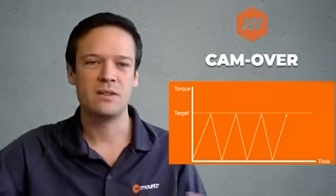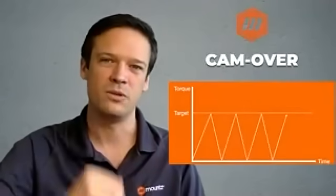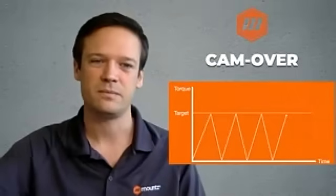We can see that with a graph of a torque delivery. This looks exactly similar to what we've seen with the FG screwdriver earlier. We reach the target torque, the tool resets, gets ready for the next operation, and so on after fastening after fastening. This, of course, is important. But another important point of the cam-over wrenches is, again, the way it works internally. We can see that there is still a spring. We can see here the self-locking mechanism of the FGC wrenches.